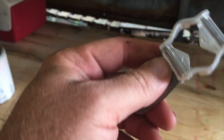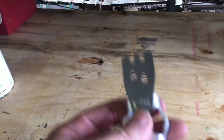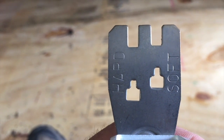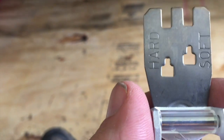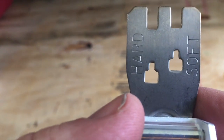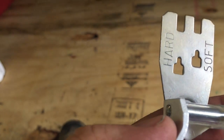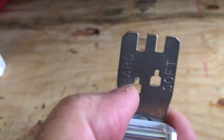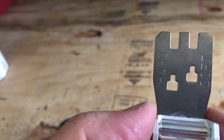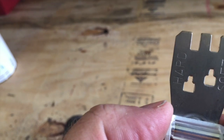It's got the guide here — this is the guide that's going to make sure you get the angles correct on your teeth. It's also got this little piece for filing your rakers down. It's got hard and soft settings, adjusting how much you take off. You can take out more on soft wood at a time than hard. So if you're primarily cutting soft wood, you want to use this setting; hard wood, you want to use this one. I'm going to be cutting hardwood — some oak — so I'll adjust mine for hardwood. I don't anticipate needing to adjust the rakers every time; every two or three sharpenings, but we're going to check them anyway just to make sure.